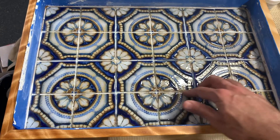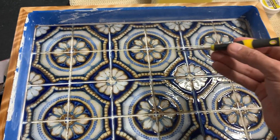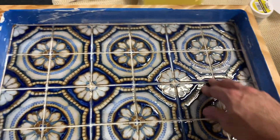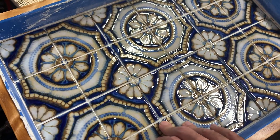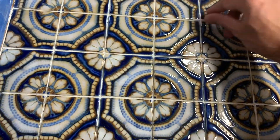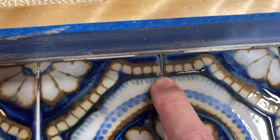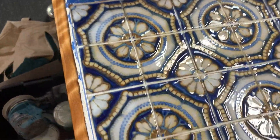The mortar has dried. I used a little screwdriver to scrape down some of the joints where the mortar came up — it looks pretty good, everything is solid. I'm working the tile spacers, using 1/16th inch and getting them set. If a three-way spacer is below the level of the tile, the grout is going to cover it.